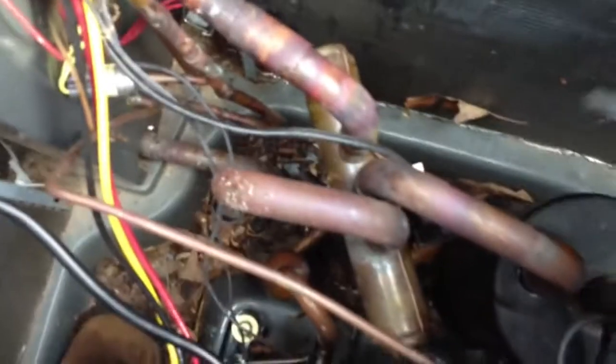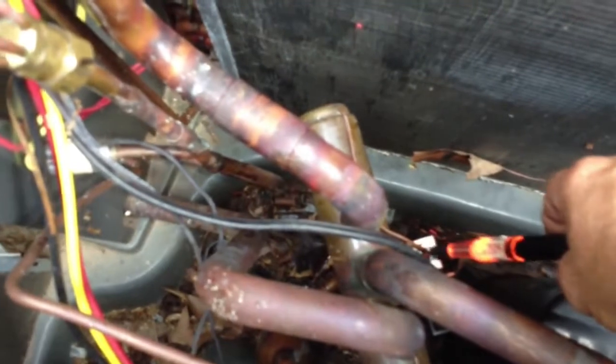Got my leak detector out. Where the three lines are going — turn that thing off — where the three lines go right there, let's get the bubbles out now. See them bubbling up right there — well, that's where the leak is.